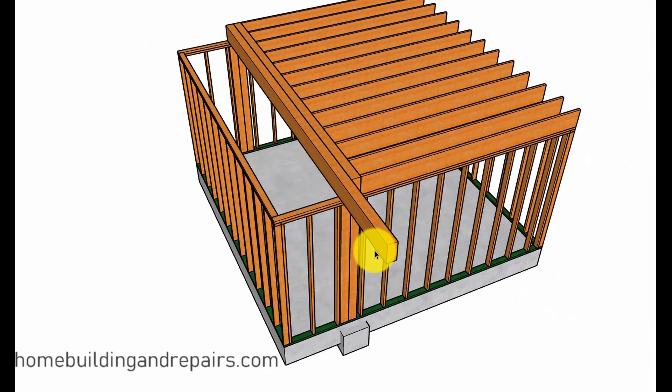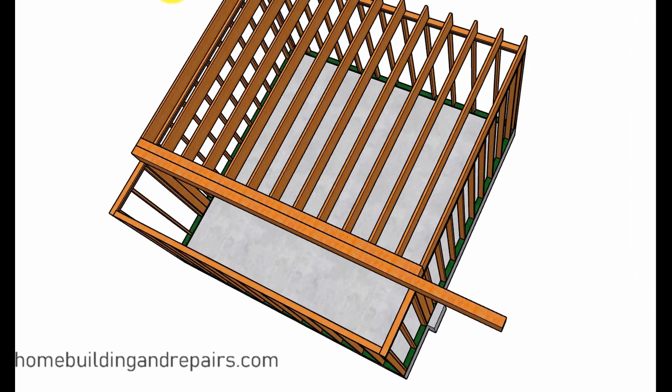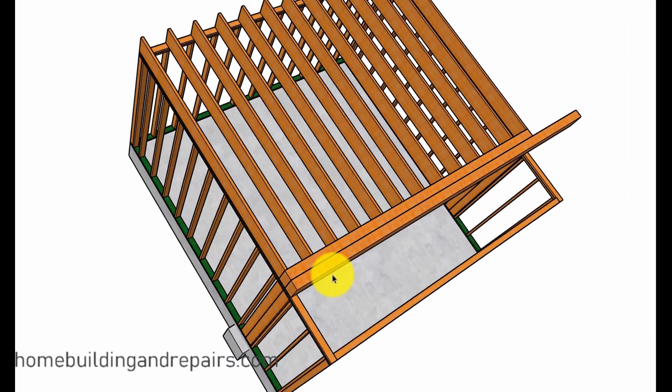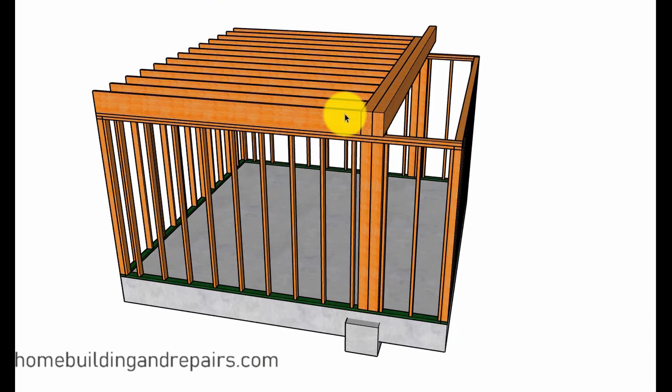At the same time, how much weight is this beam going to be supporting? This beam here is supporting the floor. If you're just going to have a beam coming out here supporting another section of the floor, it's not going to be dealing with as much weight and might not need any additional work done to the footing. This beam could be installed on either side, though it would obviously be easier to install it on this side. Installing it on the other side would kind of defeat the purpose — you'd just replace this beam with a different one.